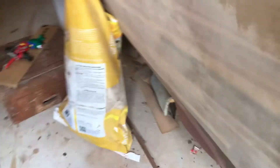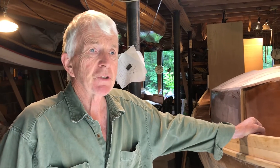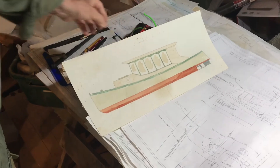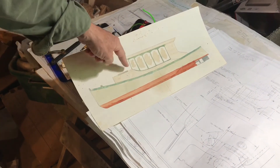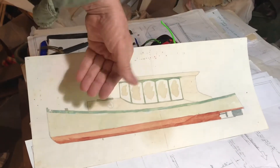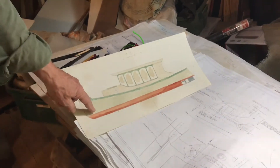Why do you need a bow thruster? I'm concerned because coming into a marina at the coast there can be strong winds — gale force winds for days on end, especially in the afternoons. This is a picture of what the boat hopefully will look like. The high roof and the flat glass sides are going to catch the wind something awful. So a bow thruster — which makes water go out left or right through a tube — will push the bow left or right depending on what you want, and that will help a lot.